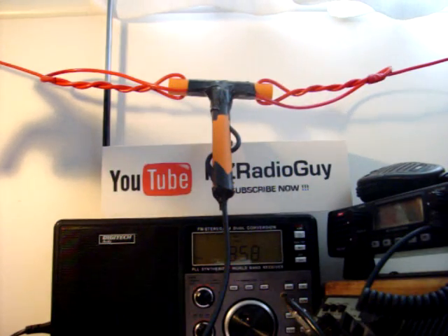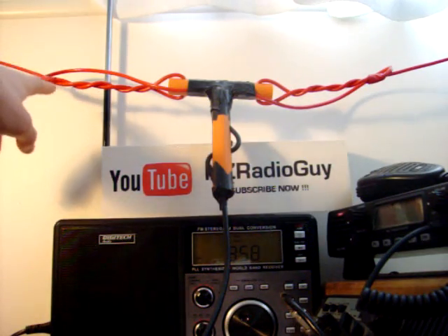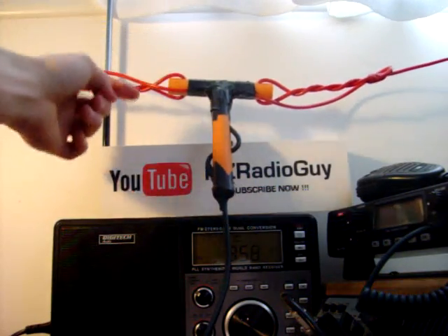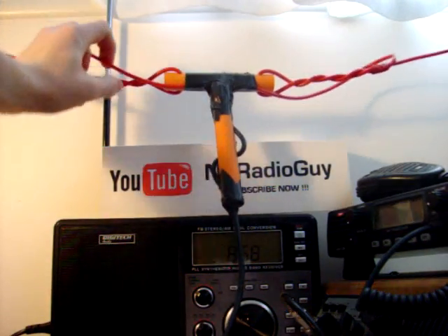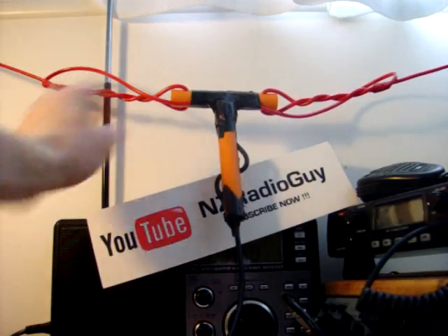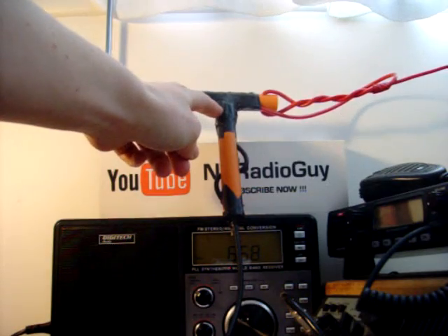Here I've got your center core — your element comes in. I've brought it through the insulator and then it wraps around itself a few times, then back out and along. It's just taped in here, and then I soldered it and soldered the coax onto it.